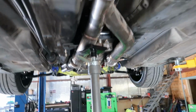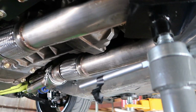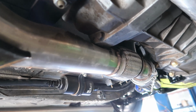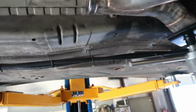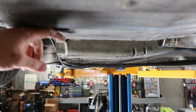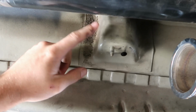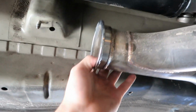We may actually not have to clear this much at all. What he has done works out really well, and see, it naturally wants to come up and hit the bell housing right there. This is a T56, by the way, but we are not going to have it up that high, and the reason being is because of our angle here. It's really hard to tell because this floor comes up, but think of this as level. This really shoots up and, if anything, is going to hit right here, and we can clearance the stud, but obviously I'm not going to clearance part of the tunnel.